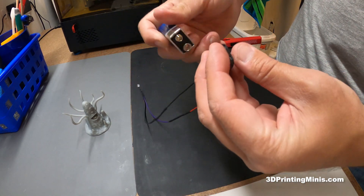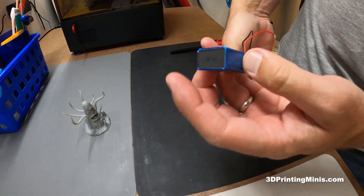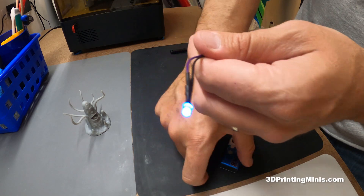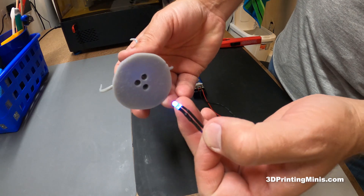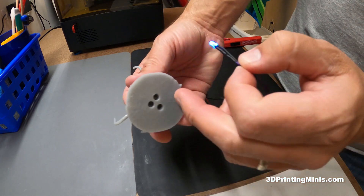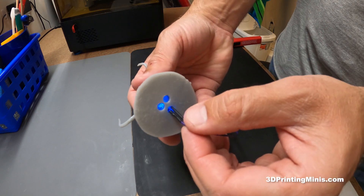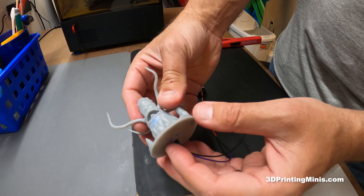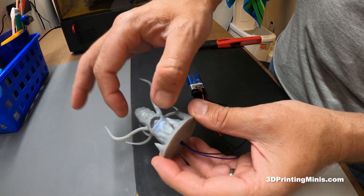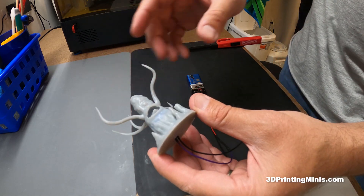The on-off switch is simply connecting the 9-volt battery to the back of this. Boom — and there you go, you got a snake light. These little wires are like six inches each, so that gives you about a foot. It's plenty big to put up in there and then to cure your print. Rinse it out, let it dry like you would normally — I let my things dry overnight — then just put the light up there, snake it in as far as it'll go. Sometimes push it all the way to the end for about a minute or two, then move it down another minute or two, and that cures the inside.